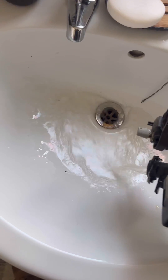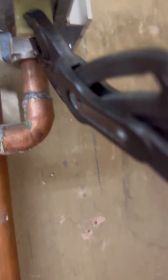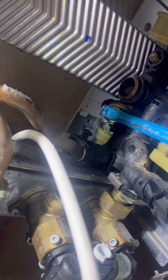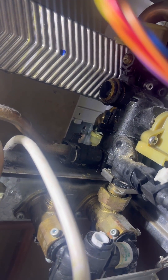A few reasons why I change a PRV like this — I take the pump manifold out so I can wash the pump in the sink. You'll be amazed how much comes out of it when you wash it. Don't forget to pull this plastic connector down, otherwise you're going to struggle to remove that PRV. First thing I do is use my crowbar and pull the pin out, then tap the PRV out — it was quite difficult to do one-handed. Some of you won't mind taking a crowbar to a Worcester, I'm sure, given the amount of times it may have cut your hand. Nonetheless, I still love a Worcester. That PRV's popped out.